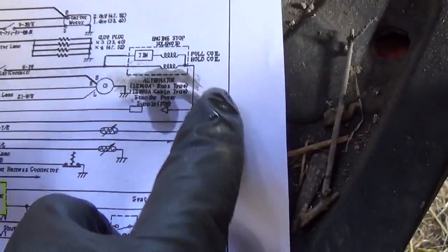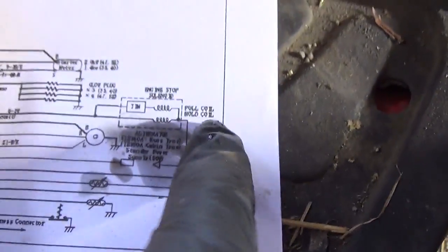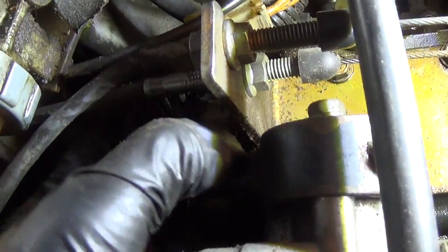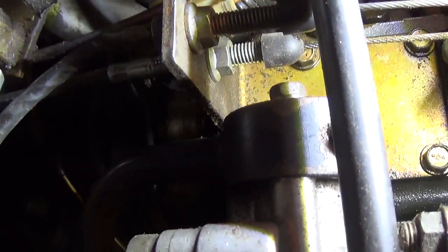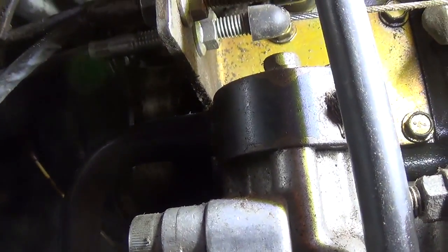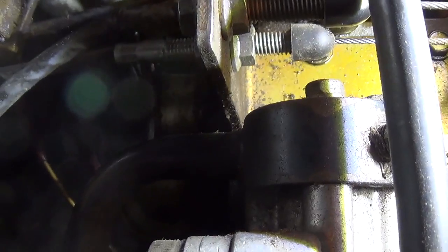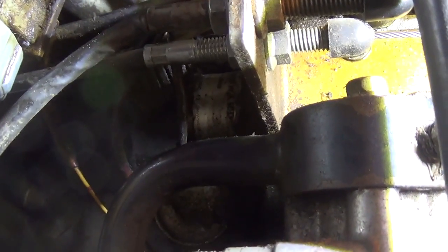Now that's definitive. One of these windings had no current going through it. So even if the hold coil works, if the pull coil does not, that solenoid does not actuate. The last check we can do before condemning this coil is a continuity check on the wire where we didn't see any current. Maybe we can pull it off and see what's going on, but that is 99% sure that's our issue — I just have to try to order one.